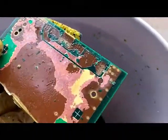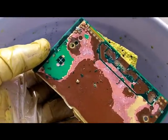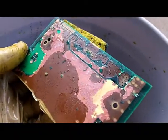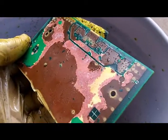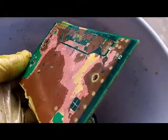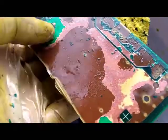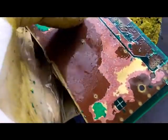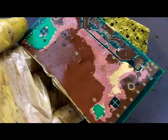An interesting thing I've noticed about some of these cards — from what I can tell, underneath the green paint or green epoxy coating, there's still a big thick layer of copper that appears to be plated with gold all the way through on these cards. Some of these cards may have an awful lot of gold on them, but it takes a very long time to digest because the plastic protects the copper — it has to digest from the edge and work its way in. You can see it's made a lot of progress, but there's still quite a bit left to go, so some of these cards will just have to digest for a really long time.